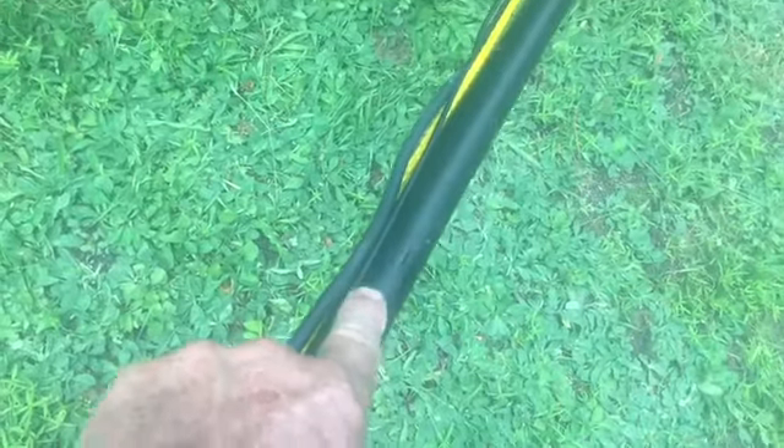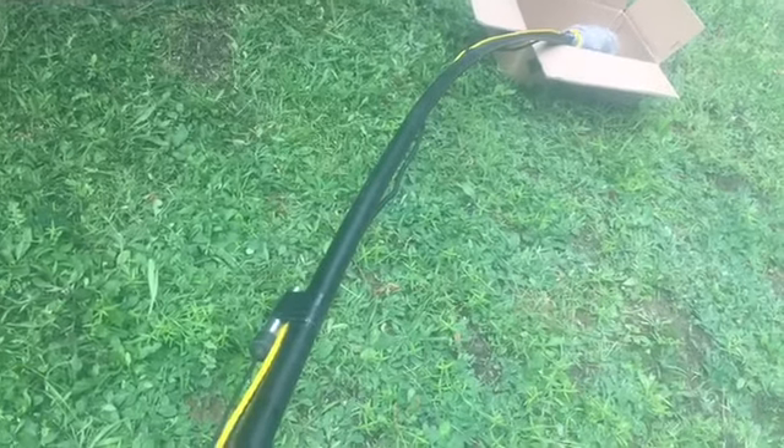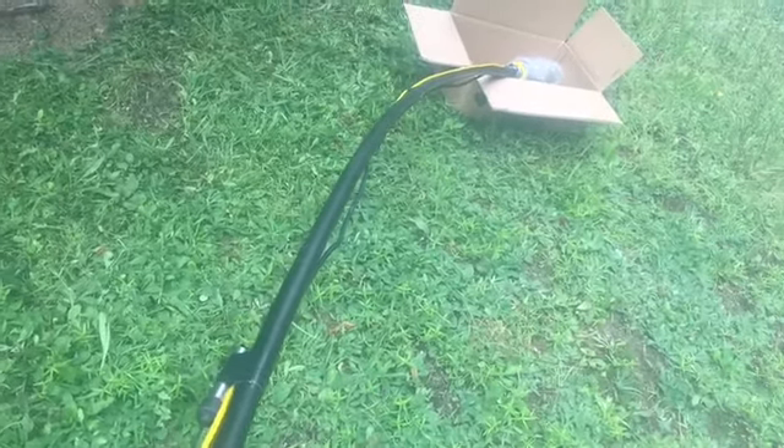Here's the sensor — it comes on a 100-foot piece of wire. It's about 8 feet up from the pump, which could be a lot closer but we've got plenty of water in this well. What you do is take the power cable, the sensor cable, and the rope, and you want slack in the wires. When this thing hangs down the well, you want it to hang on the black poly pipe and the safety rope — you don't want it stretching the wires. Keep the wire fairly loose and the rope stretched tight. Tape it about every 8 to 10 feet all the way up.